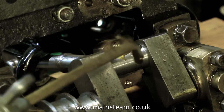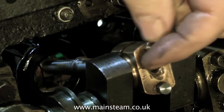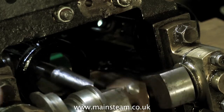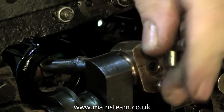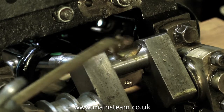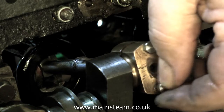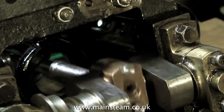Now I'm going to look at the bottom end of the engine in detail at the way the big ends fit. On this engine there are a few engineering disaster areas and the big ends were one of them. The big end bearing caps were originally held on by just a couple of slotted machine screws — this is no good at all. I'm going to fit studs and lock nuts because it would be pretty disastrous if the big end came loose when running. This is quite a big engine with two two-inch bore cylinders, and with 80 pounds per square inch behind them, a big end dropping off would cause serious damage if not total destruction.